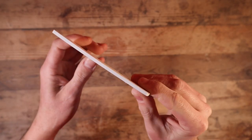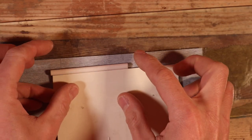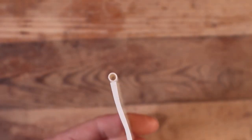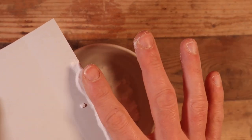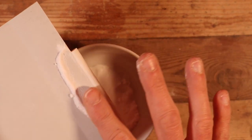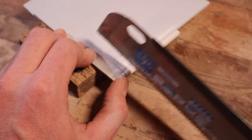The actual body of the claws was made using a quite thick plastic scrap coming from a PC casing. The knuckles of the hinge were made gluing a pipe all along the thicker edge of the plastic chunk. Yeah, the pipe, along with a suitable pin, would later become the knuckles of the joints. My idea was to create one single long claw with the knuckles already glued onto it, and then to saw it into three equal parts. I wanted this bond to be rock solid, so I reinforced it with a few rounds of super glue and baking powder, on both sides, of course.